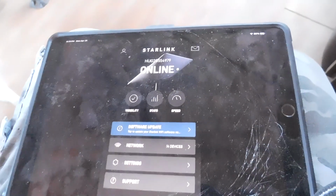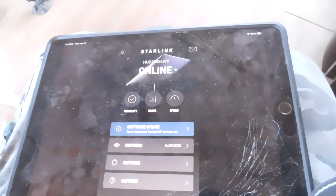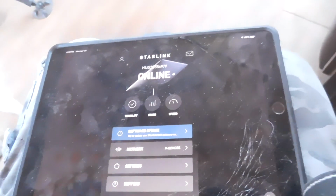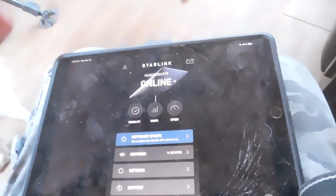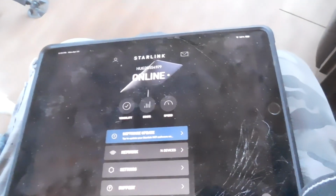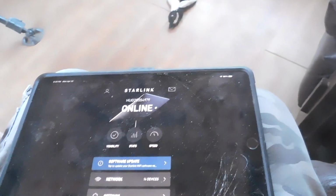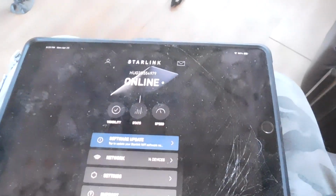If you've ever tried to connect up 13 or 14 cameras, plus every device in the house back to a new network, you know what kind of a pain in the butt that will be. Just rename the new network the same as the old network and use the same password. And make sure to turn off the old network before you turn on the new one, or things get confusing.